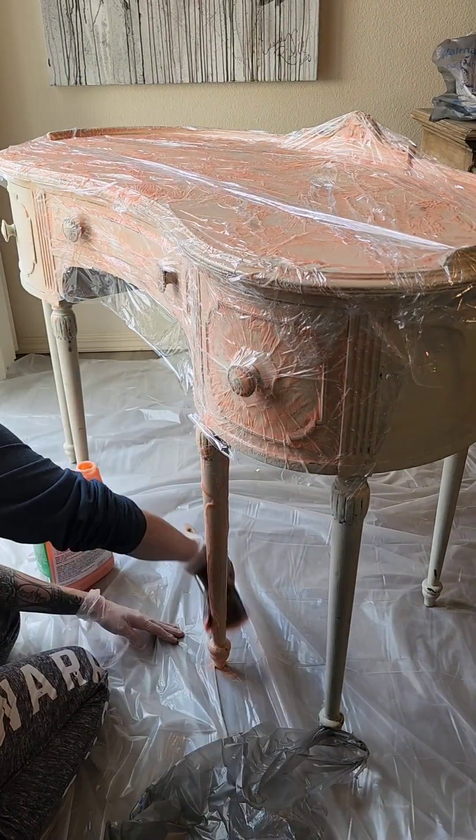On the back of the Citrus Strip it says you can use a wash on it. I tried mineral spirits, but the moment I put it on, it re-solidified everything and it wasn't moving anymore. So I tried water and realized water was the best bet. The chemical stripper did a decent enough job getting off the paint, but it turned everything into this sticky, gunky goo that was super hard to get off. I took a bristle brush and was scrubbing, using a ton of water, and eventually I just took this outside and hosed it off.